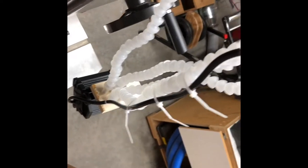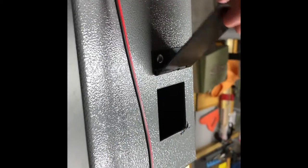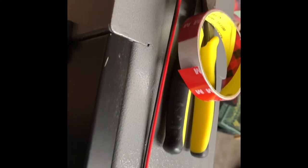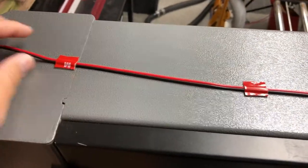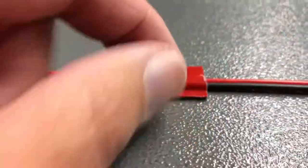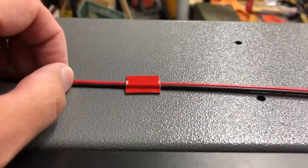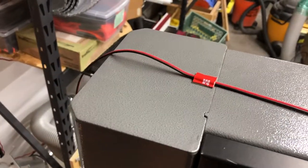We got a little bit of zip tie action here and we got a quick connector so that I can plug and unplug things if need be. One little thing to keep in mind is that the blade guide will come up through here, so along this top part I have to stay away from that. I'm gonna use a little bit of 3M tape to hold that wire in place. One tip I do: I put a piece underneath so the wire sits on it, then I cut another piece, leave the backing on it, and fold it down. This tape sticks incredibly well to itself - that wire is not moving.